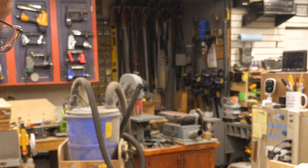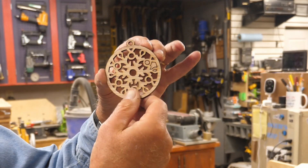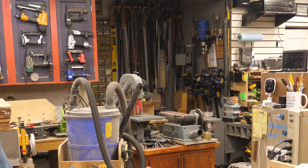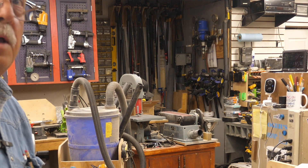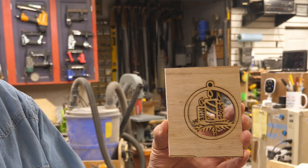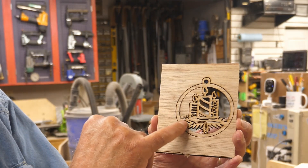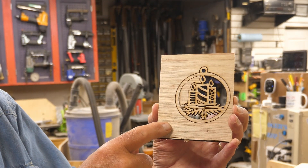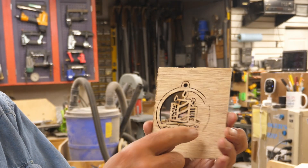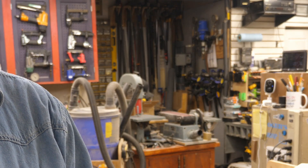350 at three passes will eliminate those little things that can come up. On this Christmas ornament, it cut everything out except that little corner right there - there was some funky stuff in the grain right there so it didn't quite cut out all the way. That's what you want to avoid. On another Christmas ornament, there's some white down in here where it did not cut through - there was some type of filler in the plywood and it would not penetrate that filler. So the back side didn't cut out, it ended up being scrap. That will happen.